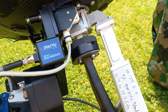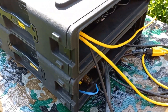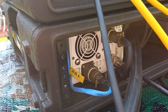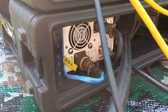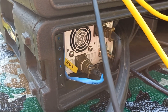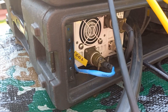This thick rubber tube coming out of the back is the waveguide, which goes over into what we call the BUC box. In there is a 65-watt BUC, which is quite a lot of power for a Ku-band system. That allows us to transmit up to 20 megabits per second on the uplink going up to the satellite.